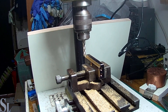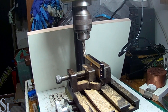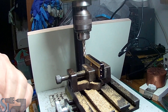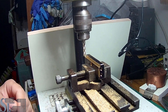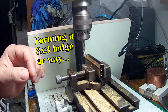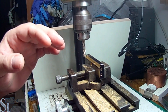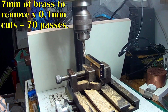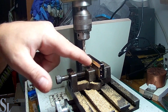It's the next week, because I do this only on Fridays. The rest of the week is devoted to family - wife and kids. We're going to keep milling this until we get to the line. I'm not going to show you the whole process - it's going to be very laborious and very slow because I'm forced to take 0.1 millimeter passes. Do remember we've got two of these to make, one on each side.